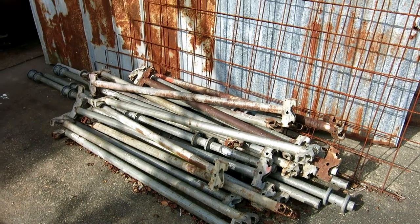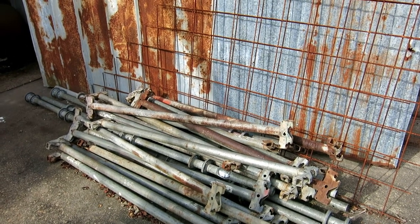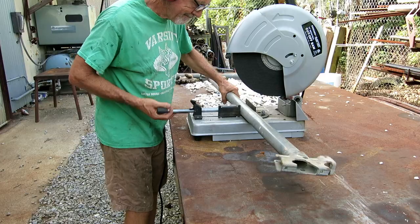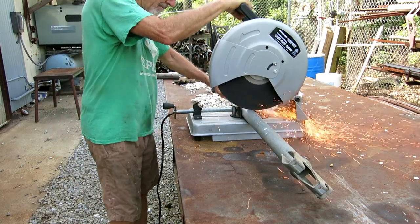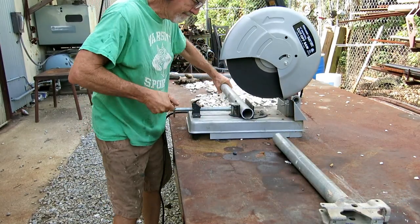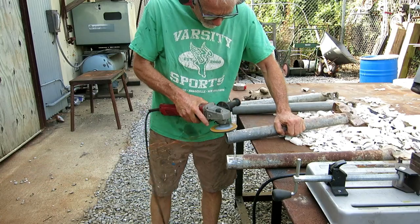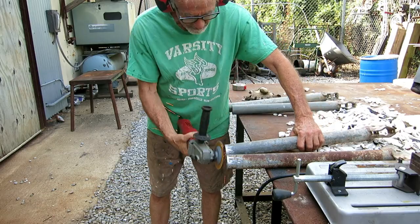The horizontal beams that came with the scaffold frame make a five-foot square, but I need a four-by-ten, so I'm going to cut some of them in half to make them shorter and splice others to make them longer. This is just a basic metalworking project. I'm using my cheap Harbor Freight chop saw, which works pretty well for lightweight stuff. Then I grind off the galvanized coating from the tubes because I need a good weld — this can't collapse and let the boat fall on my head.